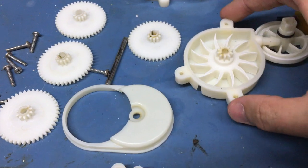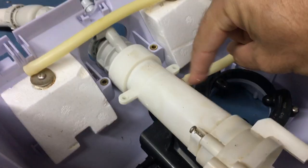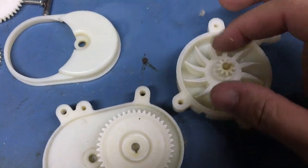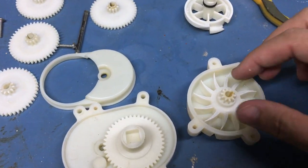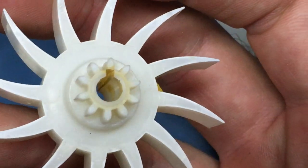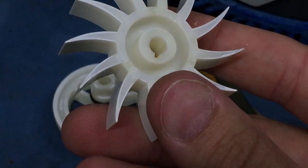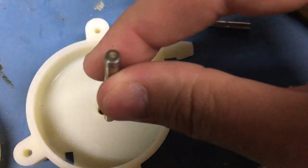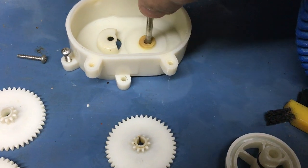Behind this is the wheel — this wheel and the initial starting gear, this barb, fits into the hose here so it's always getting water. That hose goes in here and flushes water through to spin this gear, which then in sequence does all the rest of the gears until we reach the one with the key in it. This wheel, I'm surprised, is not actually more worn given that it's the part that should be spinning the most — because each other gear is a reducer to slow the whole thing down. It has nowhere near the wear at the center, and the long pin here also has pretty tight fitment with no slop as was found with the short pin.